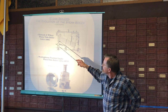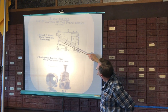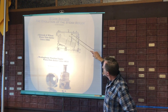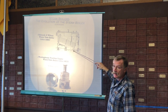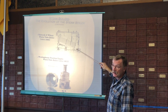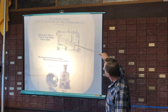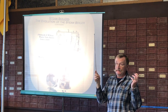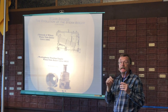The most classic cross-section of a Babcock and Wilcox boiler has straight tubes at an angle. Here's the fire. The gases, with the use of baffles, are forced to go by the tubes a total of three times before going up the smokestack. There's a nice little device called a mud drum down here, so that when you create sediment and precipitates from boiling, you have a way of getting rid of them and blowing them off. Then you have a steam drum up top with a natural convection loop, where liquid and steam can separate, giving you a much better opportunity for the steam to be dry and higher quality.